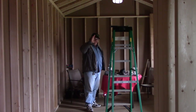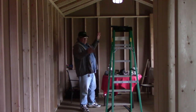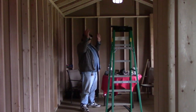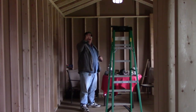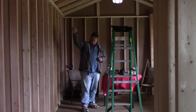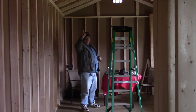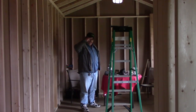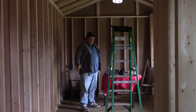When I'm finished with this framing, we're going to have a nice solid roof on this house. On this half, I'm going to have a raised cathedral-type ceiling effect. From the bathroom area — we're framing the bathroom and bedroom — that's just going to be a flat ceiling. I'm going to run regular ceiling joists across, tie them into the top plate and rafters, and run drywall over the top. That half will be a flat ceiling; this was the area I needed to figure out.